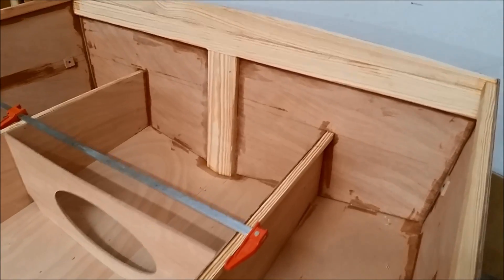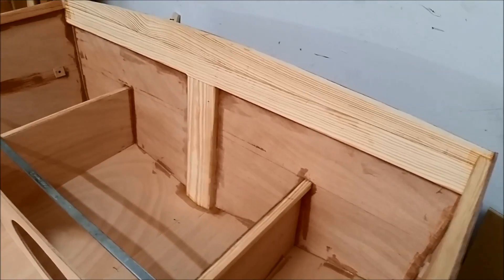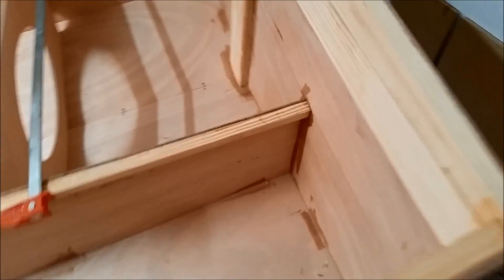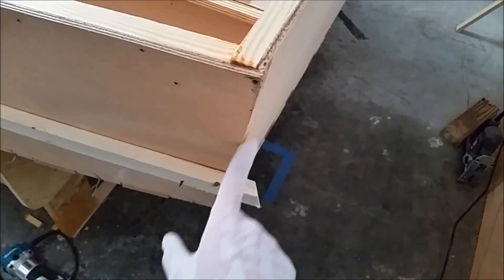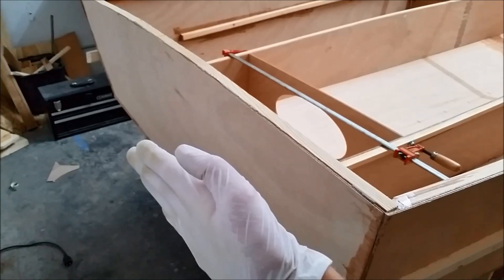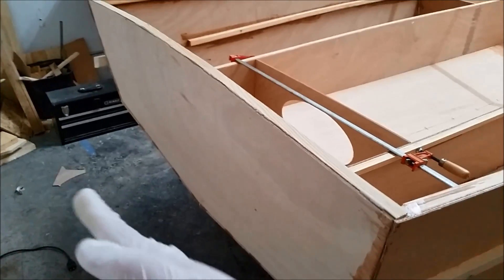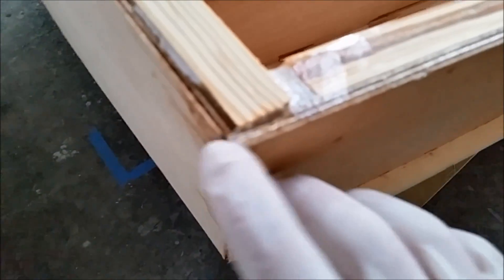I have the transom already glued on. First I laminated the stiffening beams to the transom, glued it up, and attached it to the boat with a screw on the backside of the longitudinal bulkheads and a couple of screws down the outside edge. I was careful to make sure that I didn't induce any concavity in the back of the transom — you want it nice and flat, or if anything slightly bowing outward. I also made an effort to keep all my joints nice and flush where pieces meet, and my beam I left proud so it can be planed off.